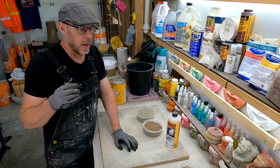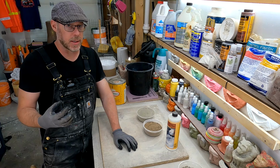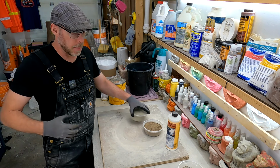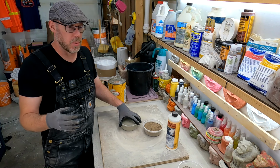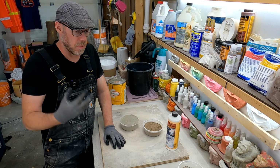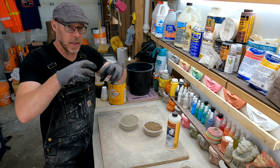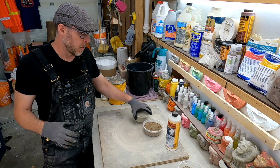This is going to enhance the ability for this mortar to zero edge and to bond aggressively to the old substrate. I mean, you still have to have a properly prepared old substrate. It can't be really smooth and sheen and just a plane for delamination. It has to be rough, and it has to have 3D structure to it such that we can get some purchase onto this with our new bonding layer.